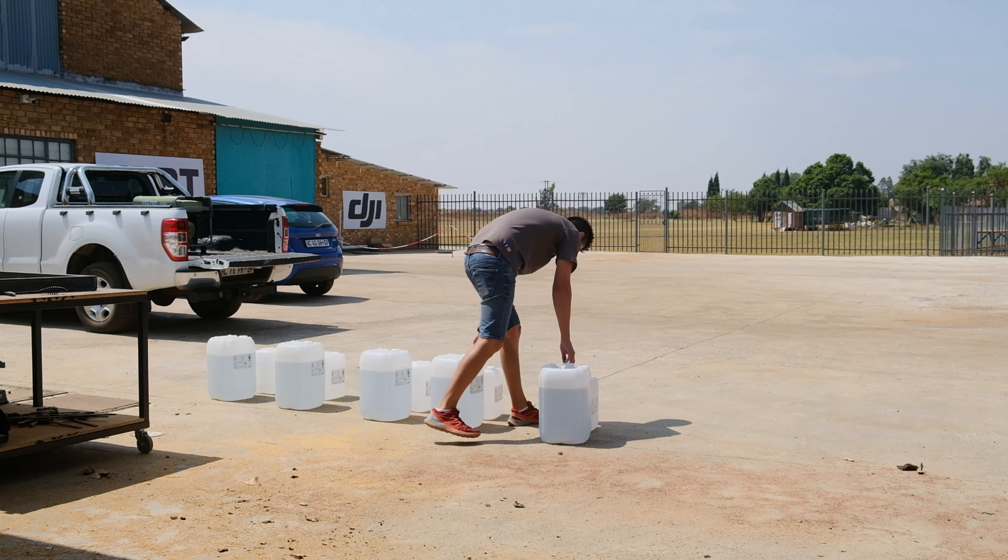Moving to removing the mold from our table. For us in a small woodworking shop, we don't have a massive CNC machine. Your table will never be 100% level after casting, so we load the tables onto a trailer and take them to a local supplier that has a CNC machine. We didn't record this step because we have to leave the tables there and come back to continue other work.